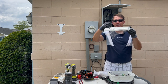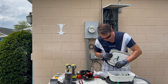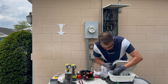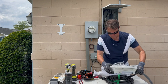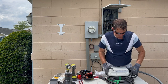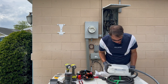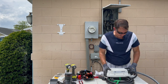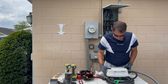Remember, if you put the cover back on, make sure you plug the light connector back in. I'm sure there's a certain direction it has to go — yep, it snaps back in. You definitely don't want to be all charged up and plugging that back in. Make sure you're grounded, because electronics don't like static electricity — you can fry it before you even get to use it. Once we get this cover lined back up, there are little alignment tabs on each side — three on each side and one on top and bottom. Make sure those are lined up or your screws won't line up.